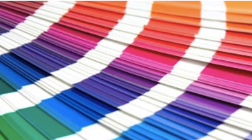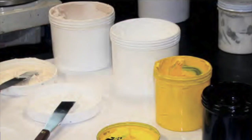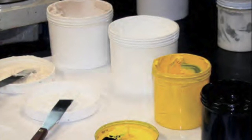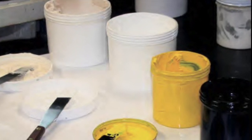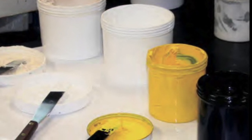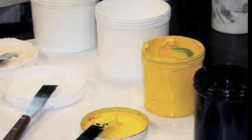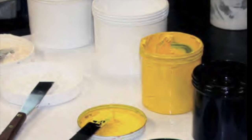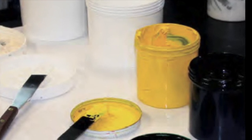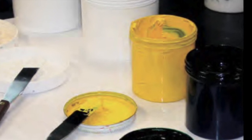The first type of mixing system introduced to the industry was the PC and Base, which is pigment concentrates mixed into bases. This is the type of system that most ink manufacturers use in their own plant to create color. The biggest advantage is that you can create color in any base you need — be it general purpose base, low bleed, low cure, special effects, nylon, or even athletic bases — giving the printer the ability to print on any substrate he needs.